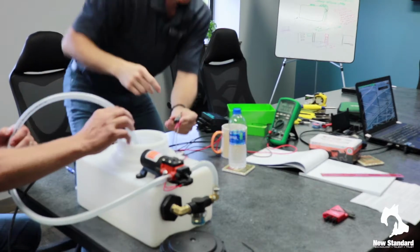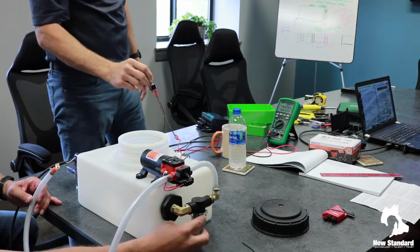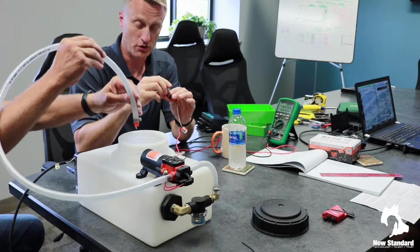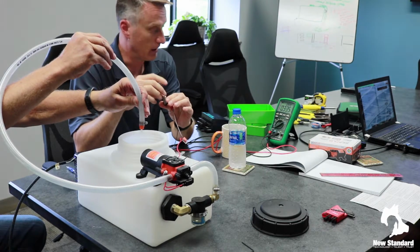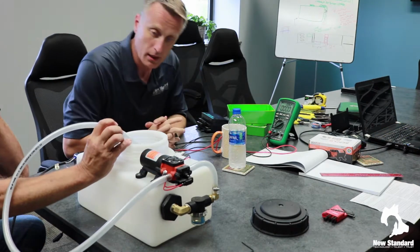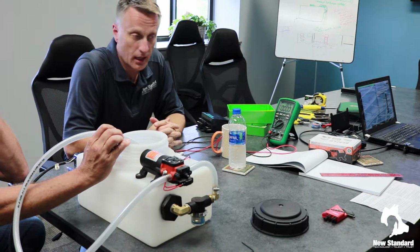This pump has a few specific requirements itself, so we did have to go find a 50 mesh screen to make sure that the pump itself doesn't get too much junk in it. Very basic right now, we just have it on a basic switch to test it out for pressure and then setting the amp draw. We've got it set right now running just over a quarter of an amp draw, even on the inrush. We feel that should stay well within the parameters of the Nedap system.